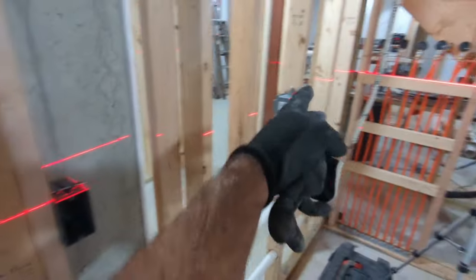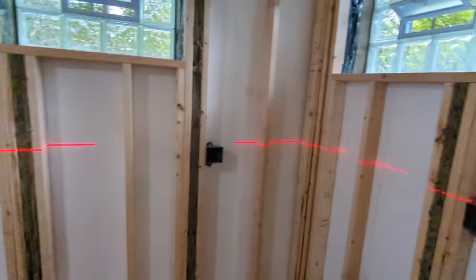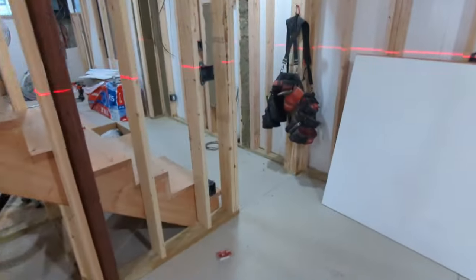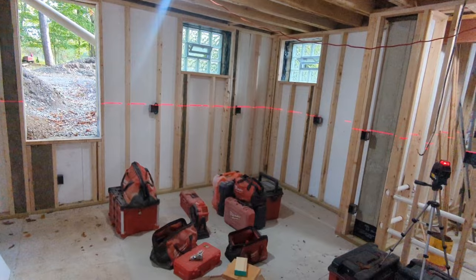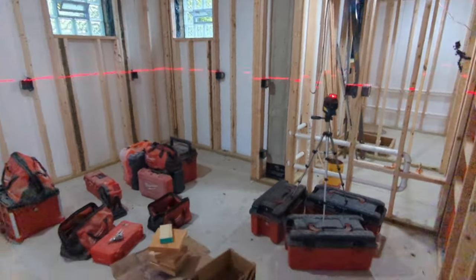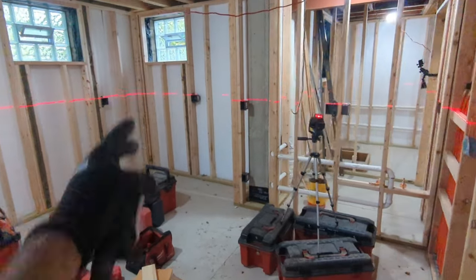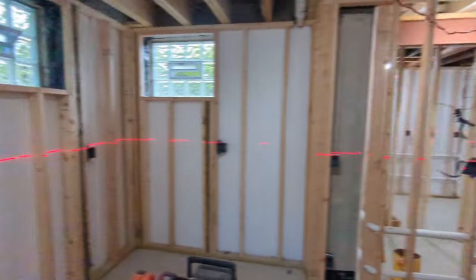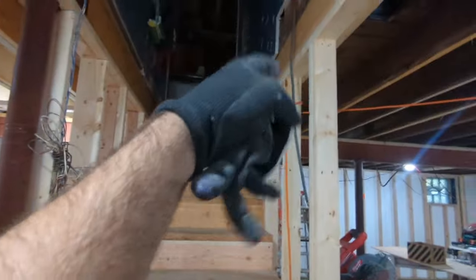If you don't want to look at a cord, you can plug something in down there. Here, we got plenty of upper outlets. This, I was going to do a switch for, like, if you've got upper cabinets with under cabinet lights in the future, if you want to flip them all on, right over the workbench stuff you've got, the other end of that switch would be here. So you have the main room light switch and the under cabinet lights back and forth right here or over there, just because it made sense if you're sitting down. I'm trying to visualize this, and I'm going to help set this up for Ed. If he doesn't use it that way, then he doesn't use it that way. But I think it's going to be a switch box, long story short. Then you come downstairs. You've got the stairwell light here and up there for just the stairwell.